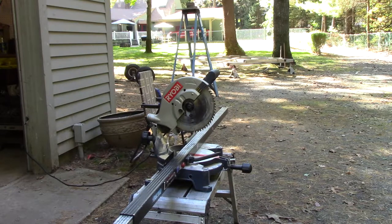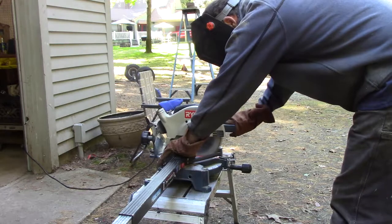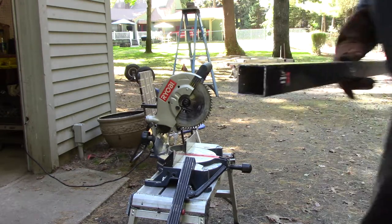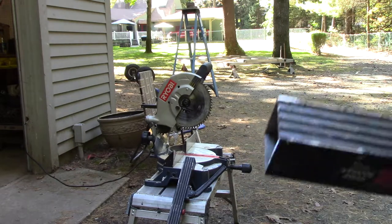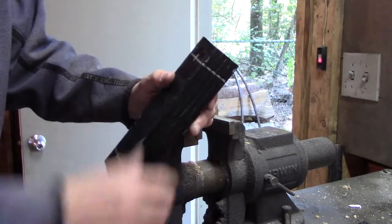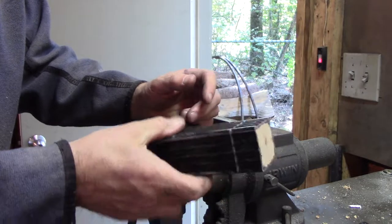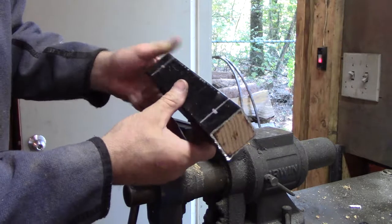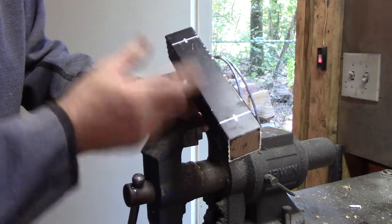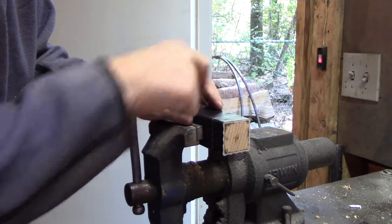No drama - that's almost a perfect cut! I'm going to use a circular saw for aluminum from now on. That came out really good and it's nice and tight in there. Now I've got to drill the holes for where the axle bolts go through. The one tool I don't have is a drill press - every time I need one I think 'this one time I'll just do without,' but I really should get a drill press.